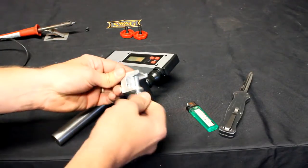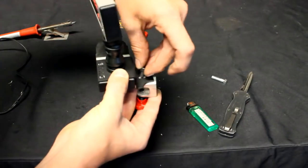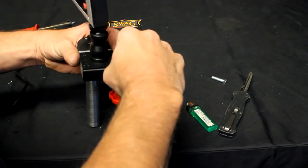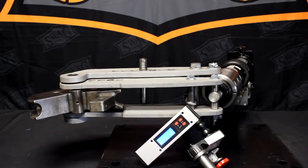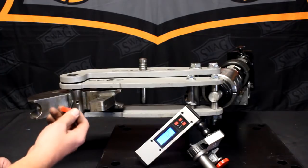Now we're going to install the beam clamp. This beam clamp will clamp on the stationary or fixed arm of your tube bender — it will contour and tighten down wherever you need it. Now I'm going to show you this piece installed on your tube bender. The very last operation is regardless of if you have a 90 degree or 180 degree die set, you're going to need to drill a quarter inch hole in the center of this piece of tubing and tap it using a 5/16-18 tap.